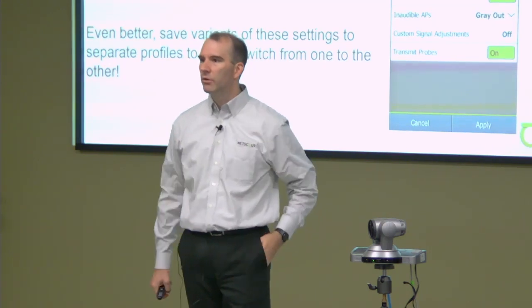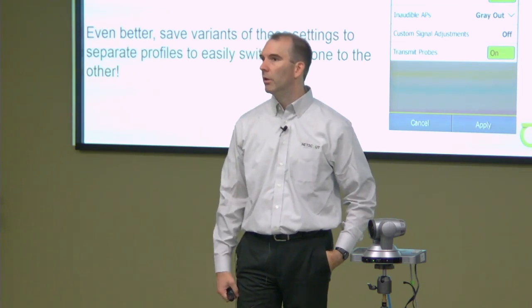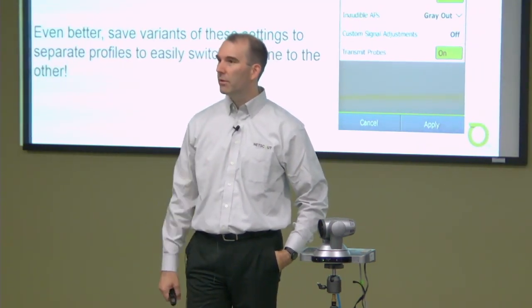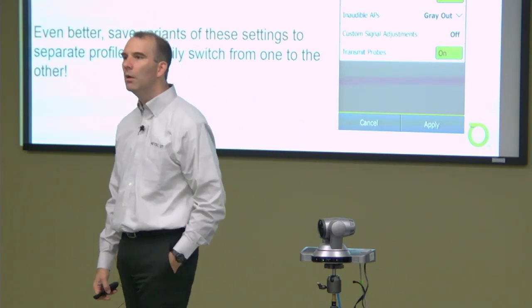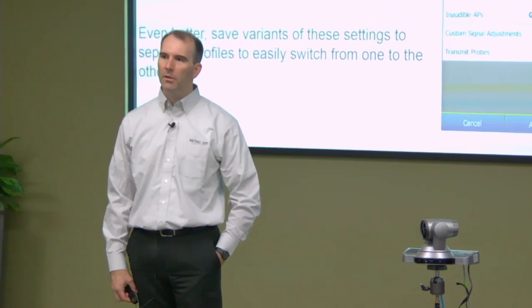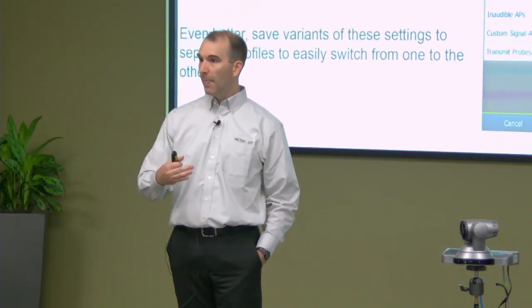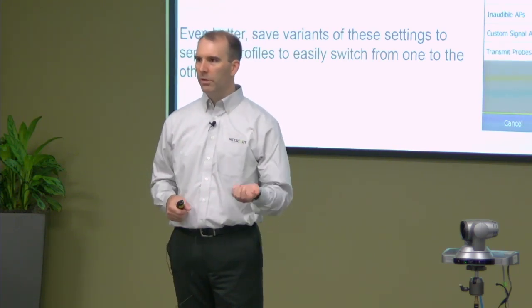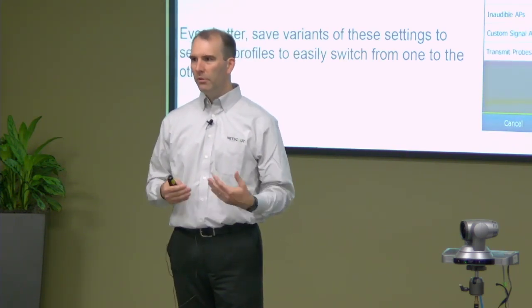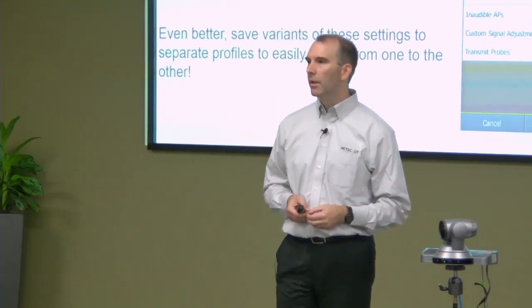Well, I know that in general for online usage, not your question, because of 11AC radios versus 11N, we certainly have a more power-hungry unit. This is the first I've heard that there's a little bit more of a leakage current draw on the unit, but I'm not terribly surprised. I think we probably got some side benefits from an external battery pack that forced us to have some protection in place, because once you have external connectors that people can do silly things with, you need some stuff in line there to prevent that.